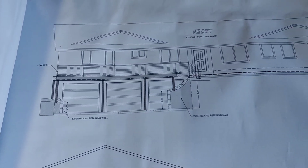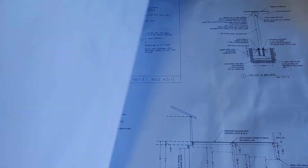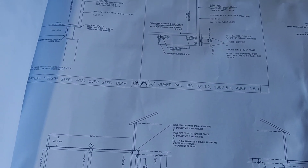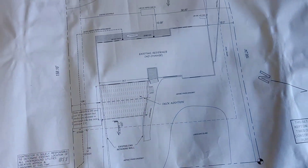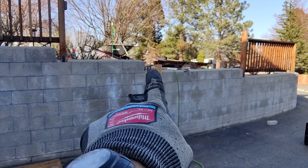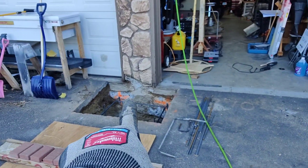I've been working on getting the footings dug — I of course didn't do that by hand. There are lots of little construction details: it's going to be a steel structure with large I-beams going across in three locations all the way around the driveway. There's a footing behind the wall, one in the driveway, and two in front of my house.